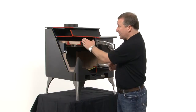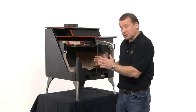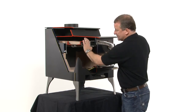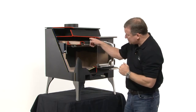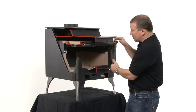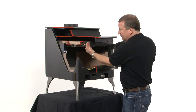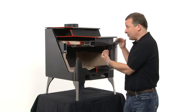The cutaway gives us the advantage that we can see what the bypass damper is doing inside the stove. In all stoves, the fire burns here, flames come forward towards the door, up over the top, past this baffle and back to the back of the stove. When it makes this loop and goes to the back of the stove, remember when we open up the door, it's a path of least resistance. So if I've got this big opening here or just this small opening for my smoke to go up, sometimes the smoke likes to drift out into the room on a typical stove.